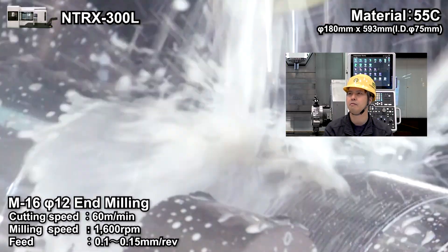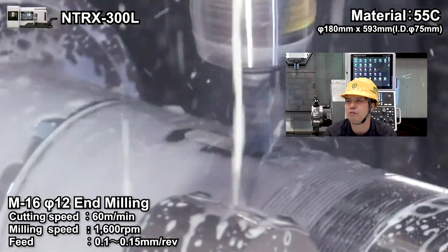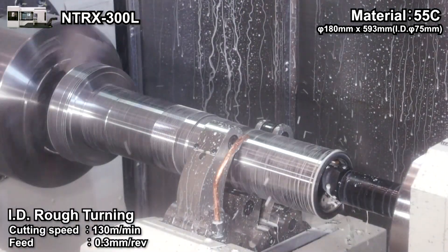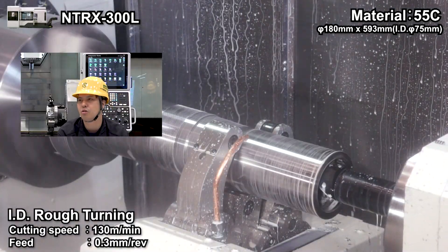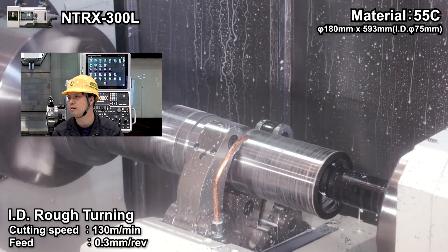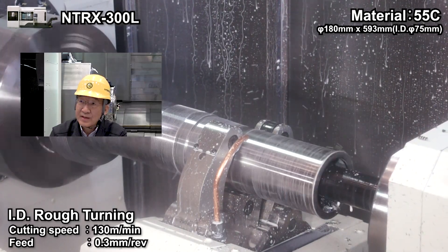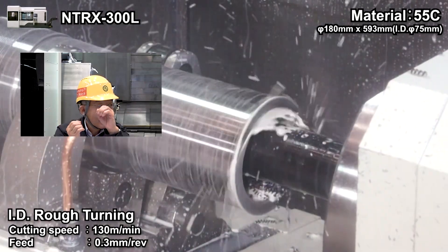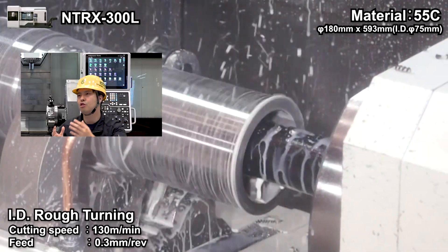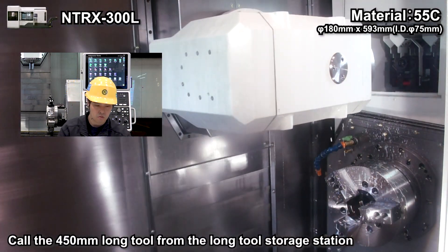Key grooving — this key is for mounting the pulley, and this is also important. This is the ideal of turning. The precise and stable machining is important for the spindle. In this case we are using a steady rest; otherwise we cannot make an ideal operation. The steady rest moves closer to the tool and cutting sections.